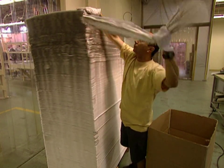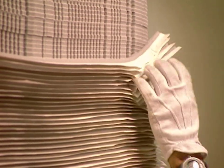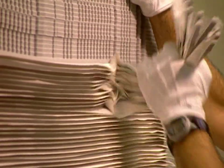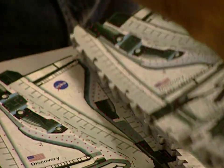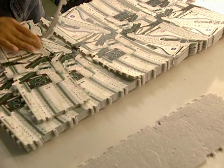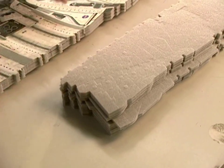Once the adhesion is finished, the puzzles are stacked on one another and they proceed to the unbuckling operation. By pulling, they remove the surplus cuttings. The same design is printed several times on a sheet, so they must separate each puzzle. This step is called the reduction of the models.